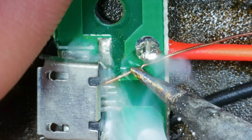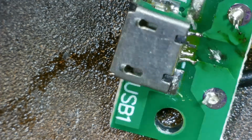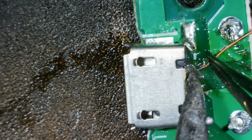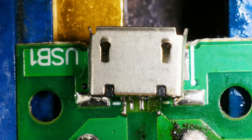Voiceover Steve here. Rather than subject you to about 45 minutes of terrible, terrible soldering and swearing, let's just skip ahead a little bit where I realise that, yeah, this port needs to come off. Let's put a new one on and let's forget about the whole sorry business. Well, I'll make a right mess of this, as usual. Right, because the port's all wonky, and I've pulled that trace off now with all my prodding around, I'm going to take the port off, and I'm going to look to replace it with a new one. I'm going to do the trace repair before I do that.